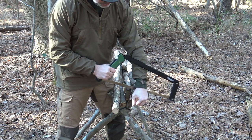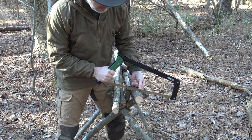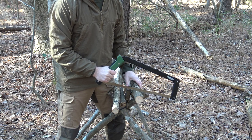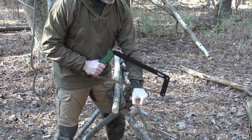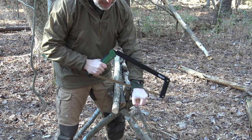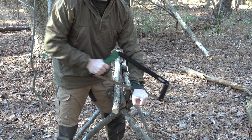Do this at least until the depth of your blade is down into the wood, at which point there's a lot less chance — if any — for it to skip out and hit your hand. Just getting that saw cut established by reaching through that frame means there's no chance the blade can slip and hit your hand, making it easy to get that cut safely established.